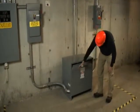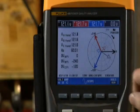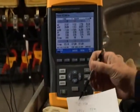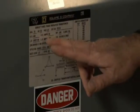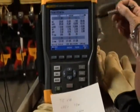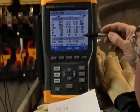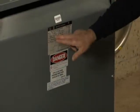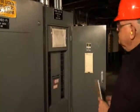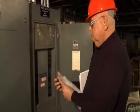Let's talk about a transformer that's running hot. Start by checking for overload. Check the power readings on the Fluke 435 Power Quality Analyzer. Compare KVA, voltage, and current against the notes you took from the nameplate earlier. If the actual power consumption you see is less than the nameplate, check for unbalance or harmonics. If you don't find an unbalance or harmonics issue, the transformer's cooling system may not be functioning properly. If the power consumption you see is greater than the nameplate, you have an overload issue. Evaluate the consumption at the loads downstream and evaluate the overall load schedule and capacity. You may need an additional transformer.